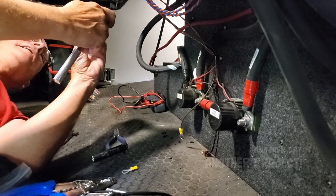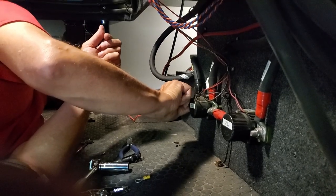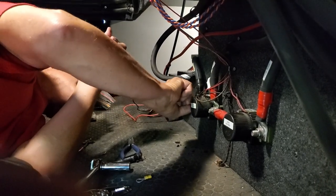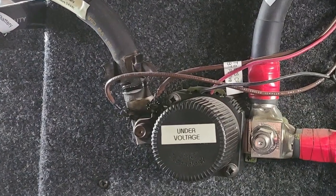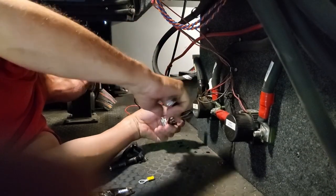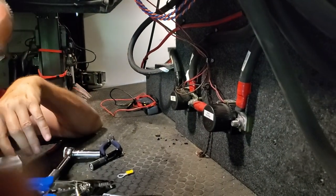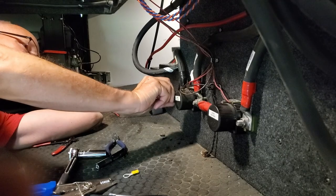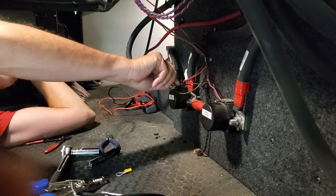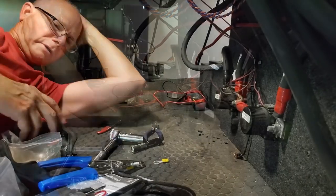Snack time. So, as we were running a set of experiments, the wires on the left side of the undervolted solenoid pretty much fried, and once everything got cooled, David realized that all those wires were not tight and they didn't have the proper lock nut on it, so he's changed out the connectors and we're going to fire everything up and hopefully it's going to work. If not, then we're going to have to order another solenoid. And hopefully that won't take too long to get.